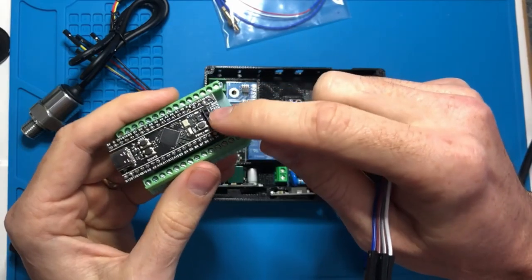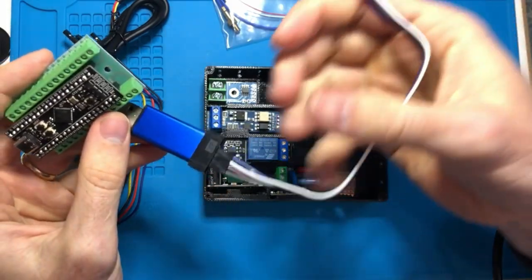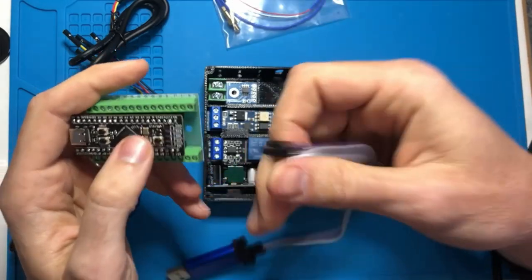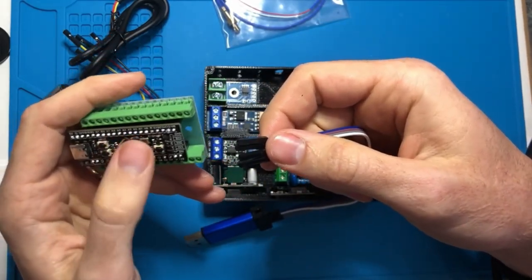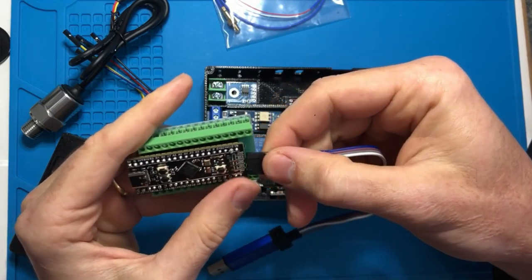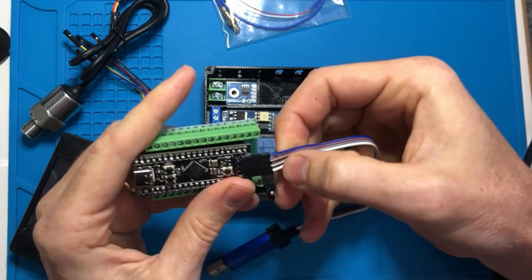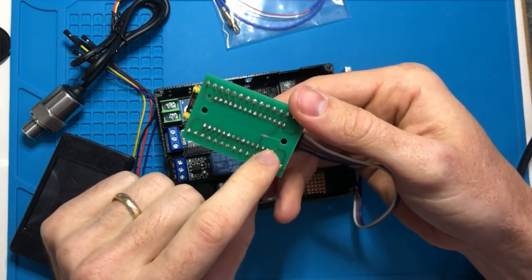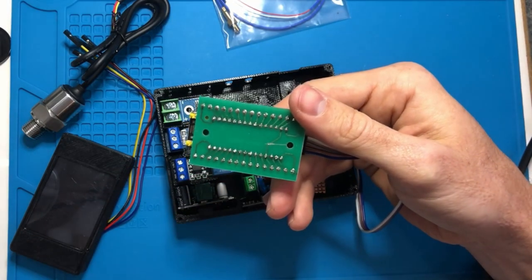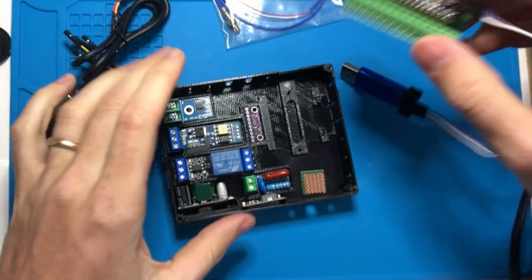Here, these are the header pins, and that's what's going to connect my ST-Link. This goes to the computer, plug that in by USB. I'm able to flash the board with the Gaggiuino software, so then it's going to be able to recognize and interface with all of the different sensors and other parts of this whole board. Some of the boards that you order may have these two grounds linked. We don't want that. So I had to cut the line that links the two to break that connection.